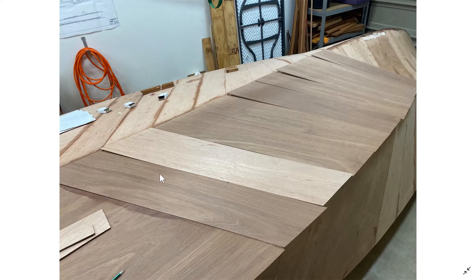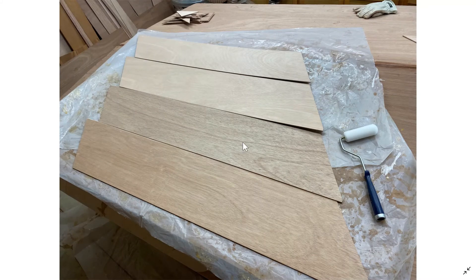These are dry fitted in place for now. When you cut these angles, they need to match as close to exact as you can get them with the adjacent pieces, which sometimes takes a little trial and error. You might have to shave off a little to get the angles to match and mate properly. That's where the table saw really helps.